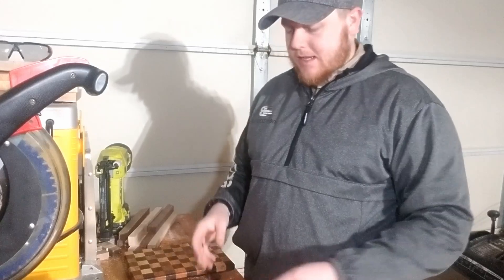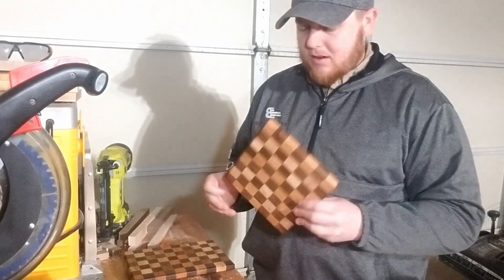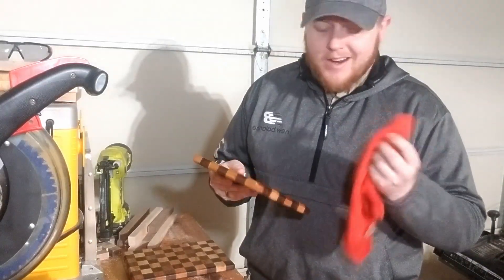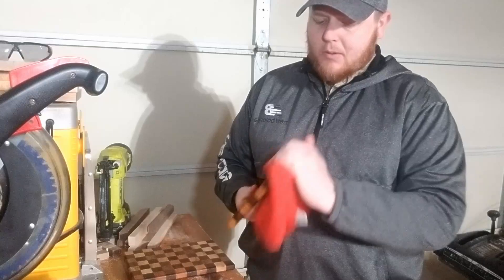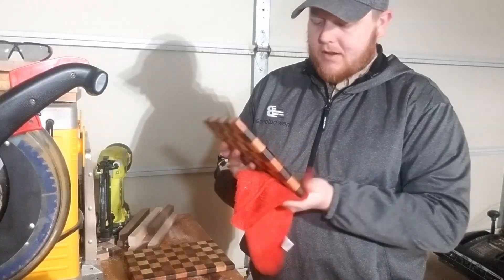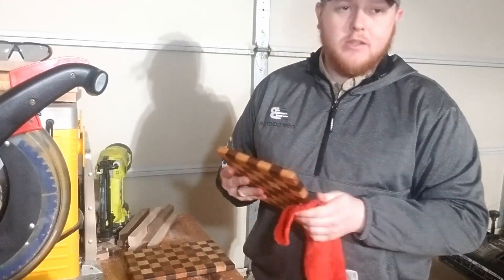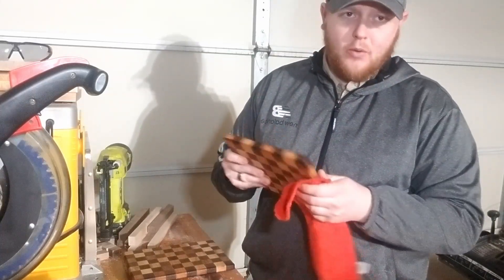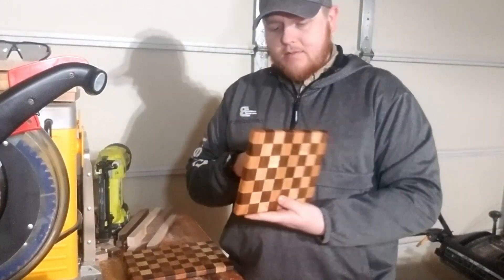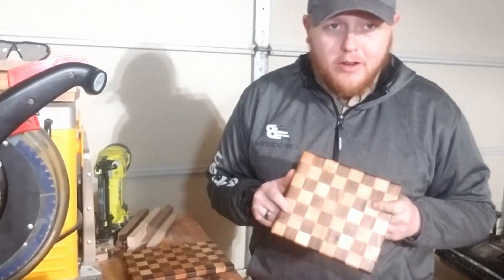Welcome back. It's been a day after we applied the board butter. These boards are feeling great — they're a little sticky to the touch, but they look great. All you need to do is take a rag and wipe away all the excess. What you're wiping away is the beeswax — the stuff that's left over. The oil has already seeped in and soaked into the wood, and that's what really finishes the wood. The beeswax is just what carries the oil and allows you to get this great finish and look. No longer sticky to the touch — it's sleek, food safe, and ready to be used in the kitchen.